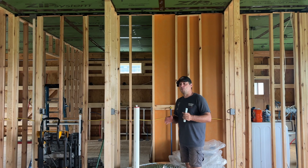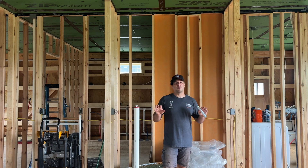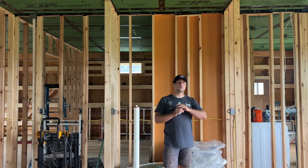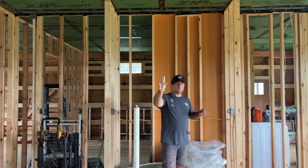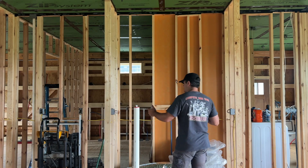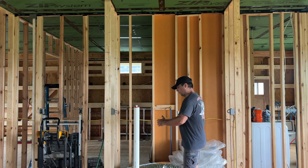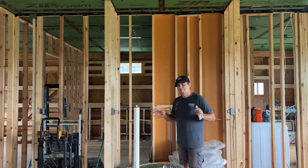Number two: room layout. Think about how you want your outlets or receptacles placed, how you want your lights, where you want your switches. This is the time after the framing is done and you're doing your rough-in to get everything placed. Before we ran a single conductor, I had labeled where I wanted all my boxes — all the outlet boxes and switch boxes were placed. I'm in the kitchen area; in front of me is the island, behind me is the range. It was important to have everything in alignment — I wanted the island and the sink centered on the range, and hopefully the faucet will split the range down the middle. Right behind that will be the pot filler on the wall, and that makes my OCD very happy.